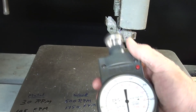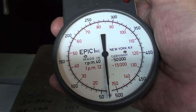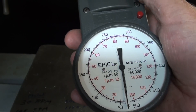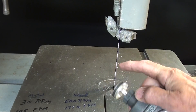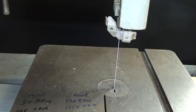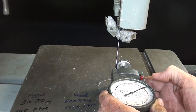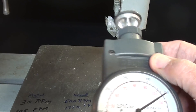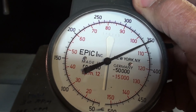I'm going to use this little tachometer here — you've seen me use it before. The red scale reads directly in feet per minute, and I will rub that on the side of the wheel, trying not to chew up the tire with the blades. I'm set at slow speed right now. The speed is 105 feet per minute.